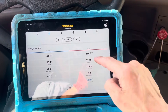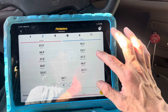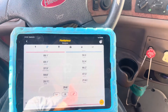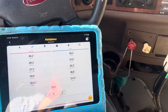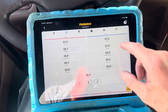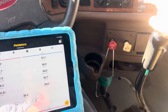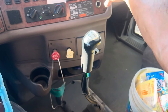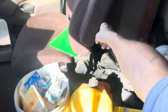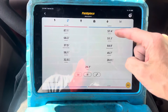Now we shut the fan off and let the pressure go back up again. We've got 59 degrees coming out. It's hot in here — this has been sitting at 118 to 119 degrees for hours. I'm sitting on a hot chair. It's going to take a long time on recirculate to cool everything down. This cold air is hitting all the hot material — steel, brass, glass — and it's soaking up all that heat and going through the evaporator. That's why the temperature is so high right now.